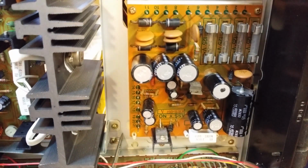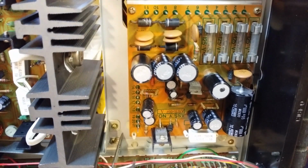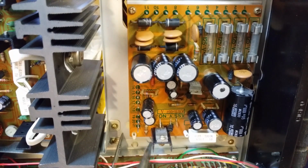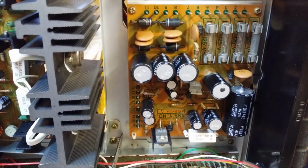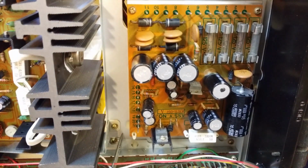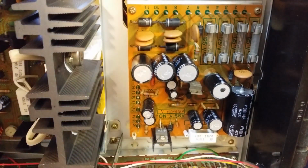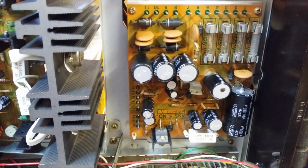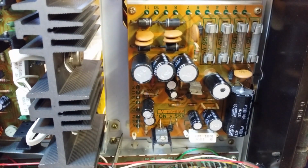Okay, right, we're now on the other side, and we can see that the white pins, 19 and 20, the two white wires on that, have 13 volts on. 21 also has 13 volts on, but it's actually fed from this regulator here to a resistor, which, I can't see very well there, it's a low value one anyway. So it's probably there just for safety, so I won't feed it through that one, and then I'm not upsetting anything that draws current through that. Right, let's turn it back around and get the board sorted out.